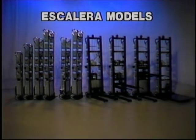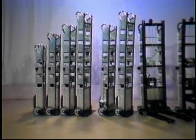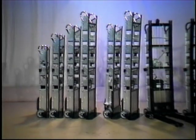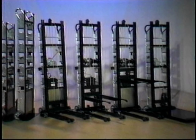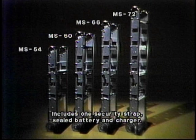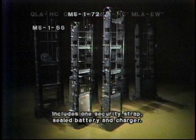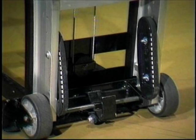The Escaleras come in many different models and sizes. The four units to the left are 700-pound capacity, ranging from 54 to 72 inches high. The 1,200-pound capacity units are the next two — available in 66 and 72-inch heights. Our forklift models come in four different configurations with and without power options. The 700-pound models come in 54, 60, 66, and 72-inch heights; each unit includes a sealed battery, an automatic charger, and one security strap. The 1,200-pound capacity units come in 66-inch and 72-inch heights and also include an automatic battery charger, a sealed battery, and one security strap. The stair climbing forklifts come in four models: QLA-HC, QLA-EW, MLA-HC, and MLA-EW. Lifts are available without the stair climbing option, with only glide belts to protect the steps, or for stair climbing with the 1,200-pound capacity stair climbing gear.